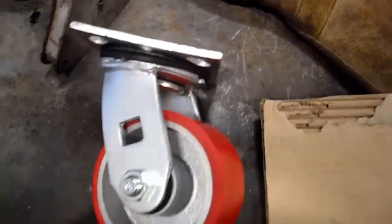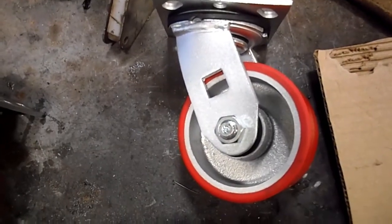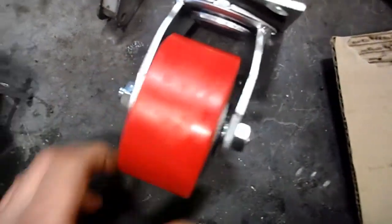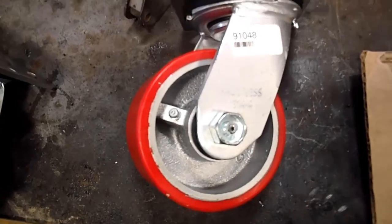Right now it has a skid shoe with a 7/8 inch shaft. The shoe and shaft assembly are all one piece — you just pull that out. They've got shims to adjust as they wear. I'm going to use a caster wheel like this. The main reason is the owners have to plow an area with patio stone and decorative brickwork, and they don't want the iron skid shoe leaving metal and rust stains behind. These caster wheels have a neoprene surface on them.